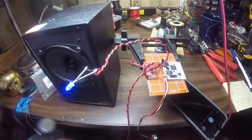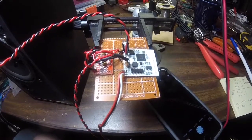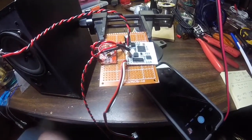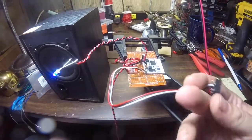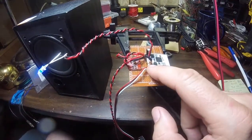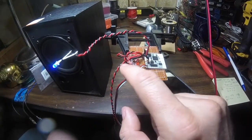Just a quick little video here to introduce this new amplifier board. This is a KRC-86B Bluetooth module, and I've got it hooked into a little PAM8403 amplifier. The nice thing about this Bluetooth board is that it has an external input so we can go ahead and add a jack on it. It's got a LED pairing light, and because you're coming out of it and going into a separate amplifier, you can put a resistor network to get a mono signal going into your amplifier.